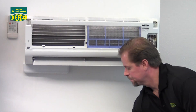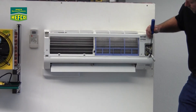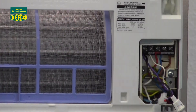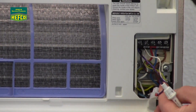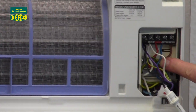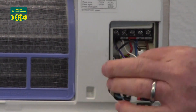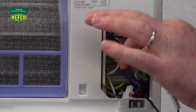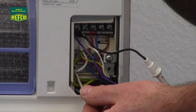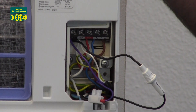So let's talk about the wiring. On this particular fan coil, you've got the line voltage coming in from the utility. This one has European wiring colors — brown being your live and blue being neutral. Then we have S3, S2, and S1 respectively. This black cable is from my pump. I've got two alarm wires, a live, a neutral, and a ground. Ground goes to ground or your earth. Your white wire or your neutral goes to your S2 terminal. Then your black wire — you're going to put your inline fuse — and land that together with one of your purple alarm wires. The other purple alarm wire is going to be connected to your S1 line going to your outdoor unit. There are other types of fan coils that are going to be powered from the outdoor unit to the indoor unit, and we're going to show you how to wire those in just a second.